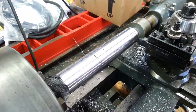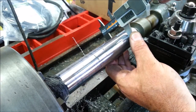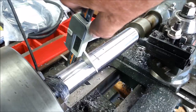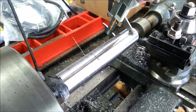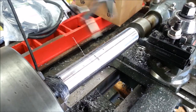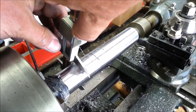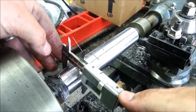So we were at 1 inch 310. And then... boy, this tube is really hot. And we're at 1 inch 3... Am I getting a taper? I'm 1 inch 319 here. 1 inch 316. I can't have a taper. Actually, I could have a taper, but it ain't good.